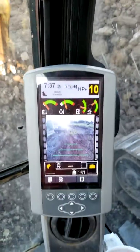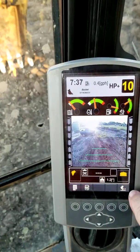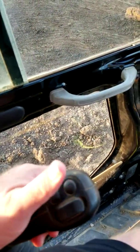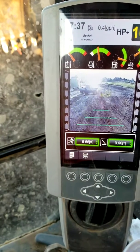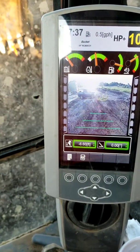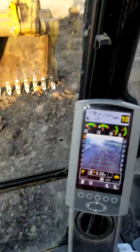The transit's over there, so now we go down here to the screen — that's your transit. We press this button and see that little bucket icon pops up showing zero zero. So we take the right trigger, pull it, and then adjust with the toggle switch — the rocker switch — for how much cut we have. On my stake, my lat says a cut of six six. It technically says a fill of two nine, but it's six six for me. I captured that at six six and pressed this button — it pops up and says a cut of 6.56 off that hub.